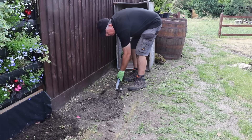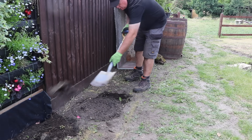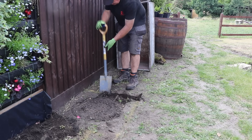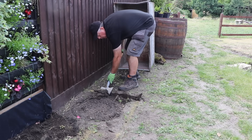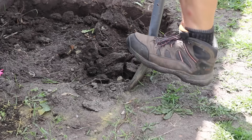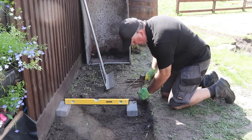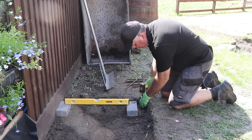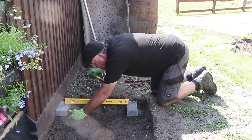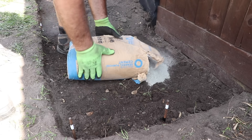Let's have a look at a recent project I did in the garden using this method. Just either side of my green wall I've had my barrels sitting there for the last year, sitting on soil and not really level, and cutting the grass around them is becoming a bit of a pain. So I want to put in some block work so they can sit nicely on that, and while I'm doing it I'm going to do a little raised bed in front of the green wall. The project is essentially two to two and a half square metres of block work paving. The first thing I do is dig out enough soil so the blocks and the sand course underneath can sit at around about the same level as the current ground — and this is where things change. Rather than taking out any more material, the base is going to be this cement-soil mixture, so I need to add some cement.